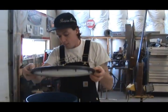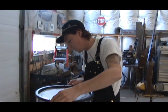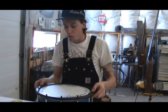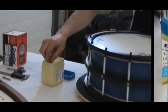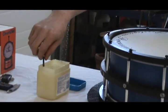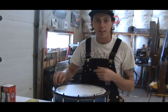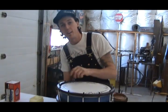Generally, if you've had it for a while and you disassemble it, it is good practice to take your lugs and just put a little bit of petroleum jelly on them — available at any grocery store. Just dip it in there. It helps lubricate and prevents galvanic corrosion and your lugs from seizing into your hardware if they stay seated in there for a long period of time.